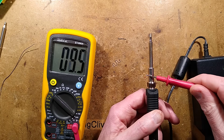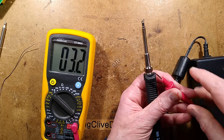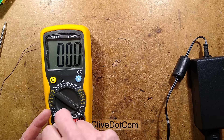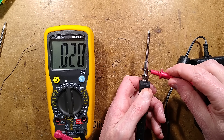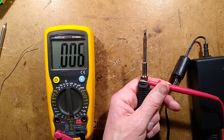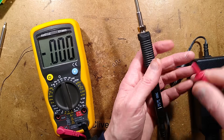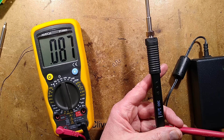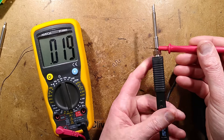Let me get a better connection and try again. If I change this meter to microamps and measure the leakage current — keep in mind this is normal for these power supplies — the current that's leaking is not a huge amount, but it's still significant. It varies a bit on the unit. At the jack it's about 125 microamps. At the tip it's not too bad — about 20 microamps — but it is still significant. I'd rather the tips of these were grounded.